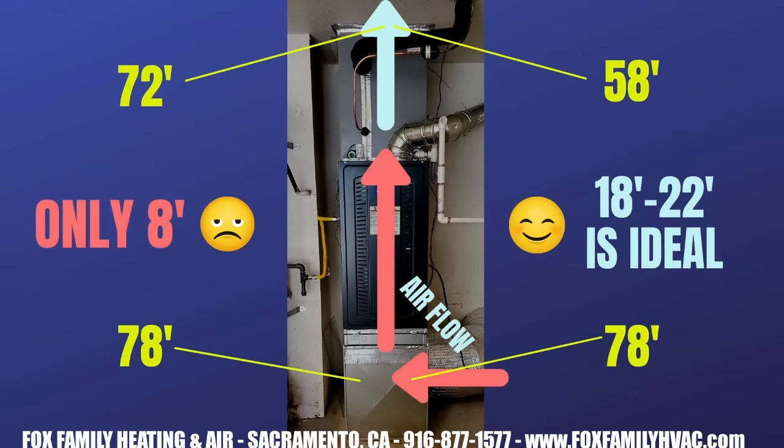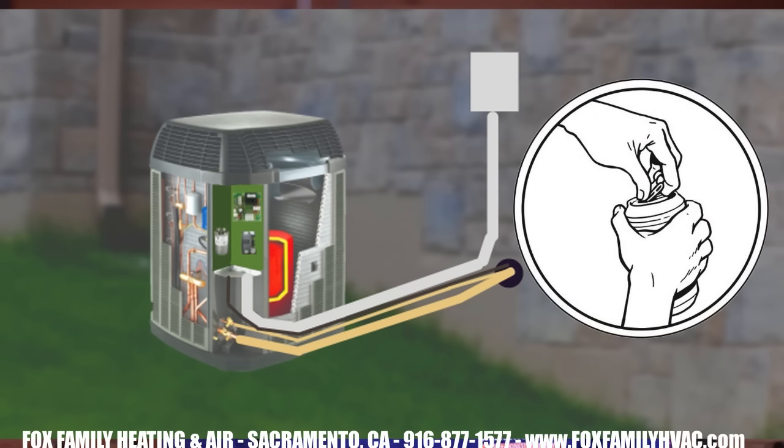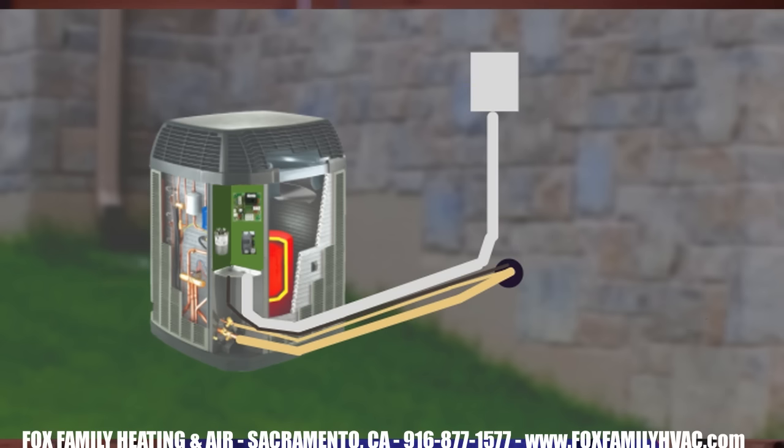Knowing this, let's grab your temperature probe and check the return air and supply air. Here you notice the difference between the two is about 8 degrees. As a tech, you know that the temperature split should be around 18 to 22 degrees. Next, let's head out to the outdoor unit to feel if the suction line is cold. Now, there is some validity to the old term 'beer can cold,' but it should not be the measure that you go by to check the refrigerant charge. It can, however, give you a clue as to the condition of the system.